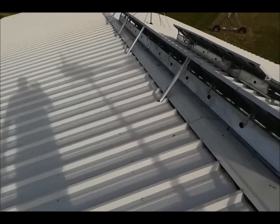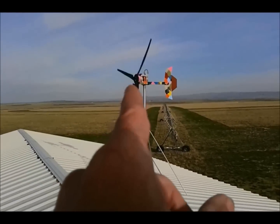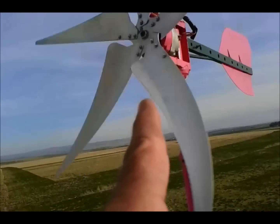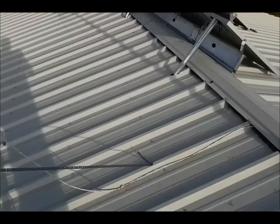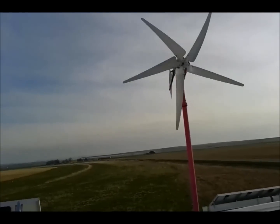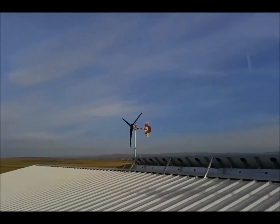But you compare it to these over here and these suckers are really moving. These will start up literally at the same speed as the Windy Nation five-blade — these start up about two to three miles per hour faster than the Missouri blade. But these blades right here, they get to a certain speed and they kind of stall a little bit. Those three blades — at 21 miles per hour yesterday I was hitting over 30 amps. The production levels are very high on them, and we're probably changing all of them. I honestly never have liked sword blades; they're not the best in the world in my view.